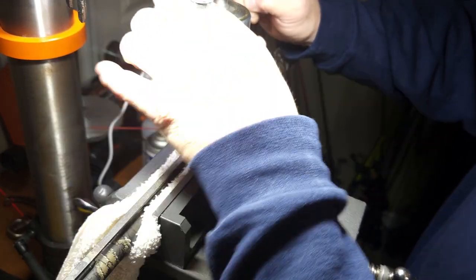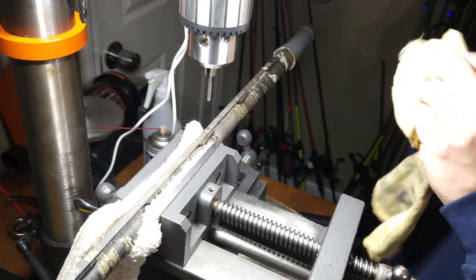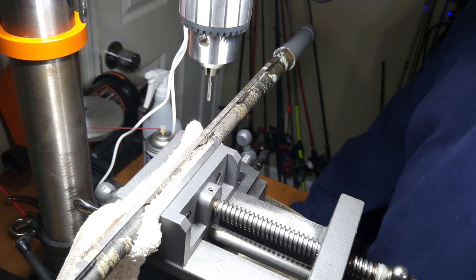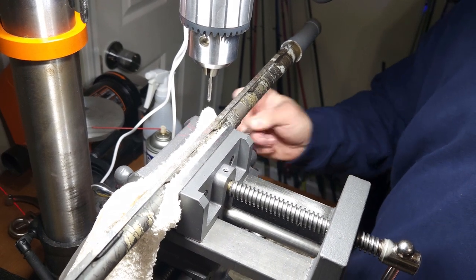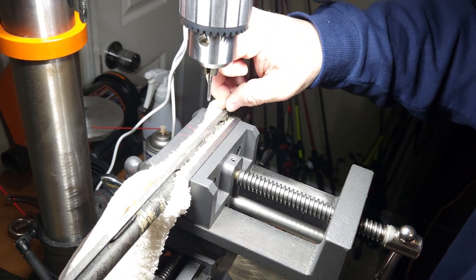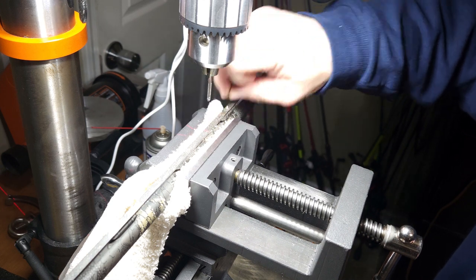So I'm going to turn it several times, and I'm going to back it out as I raise the handle up. And you'll feel it release. Alright. That's where we needed to be. I think it should thread in there just fine. Chips out of the hole. I'll find our sight bead and move this back over here where I can get to it. I got nice threads in there. And it threads all the way on down just like it needs to be.